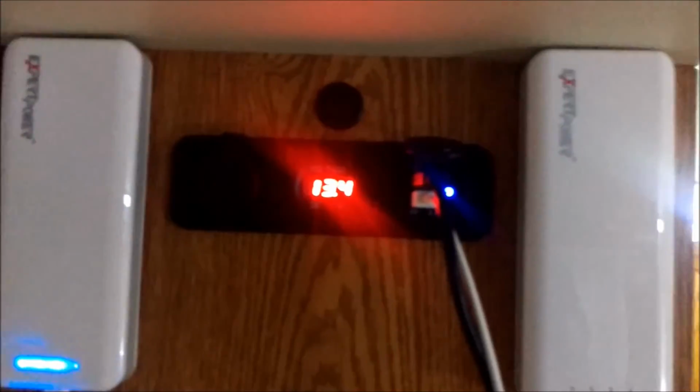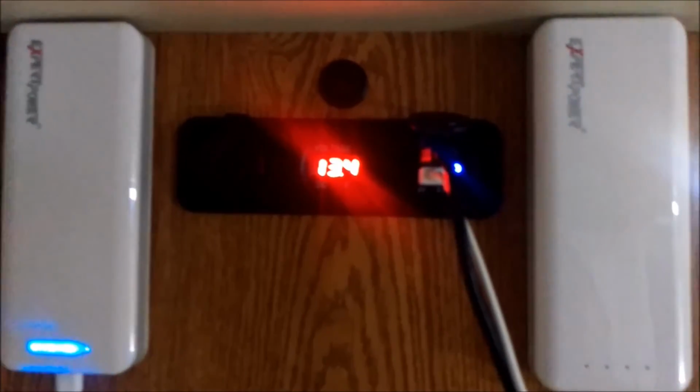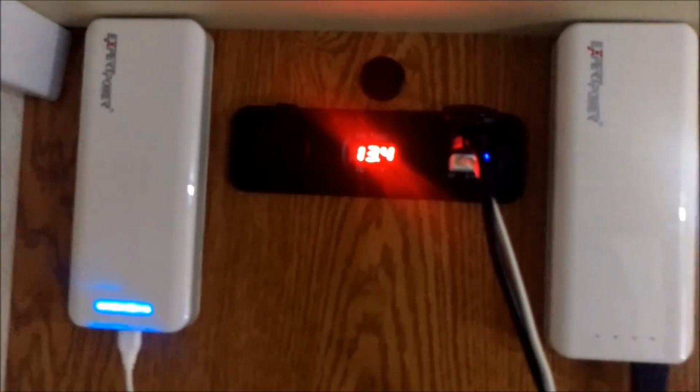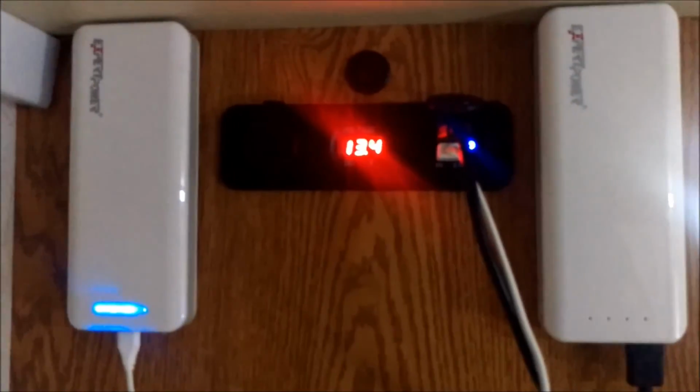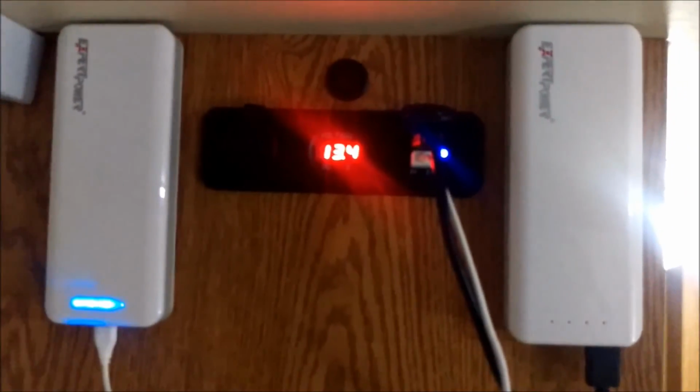It's a 3/4 inch hole, filed out a little bit to allow it to fit in nice. And it's tight. I pushed it in there. And that's it. So there you go. Adding another switch is that easy. Just break the hot lead, put it on the 2 gold connectors, and leave the other connector. You'll see there's one tab on the back of the switch that's a different color than the rest. That's your ground.